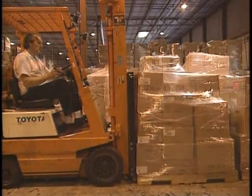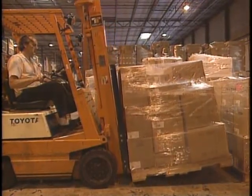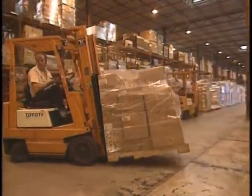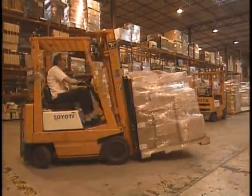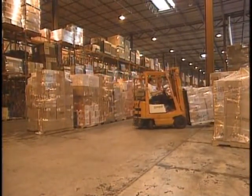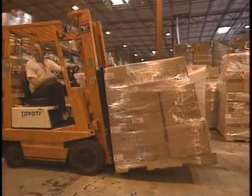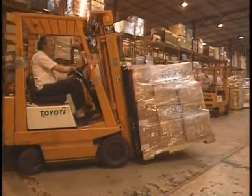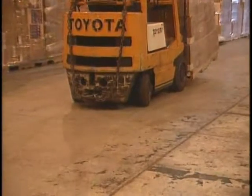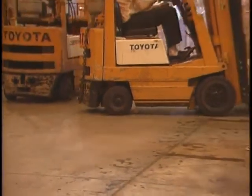Another factor when traveling is compensating for the rear end swing of the truck. Let's watch as this operator moves in a staging area of a warehouse and makes a right turn to load a trailer. The unattended lift truck parked in the staging area creates a hazard for other operators. Think about the safety issues this operator should be considering. Now let's watch again and hear what the driver should have been thinking: 'This is a staging area, so I'll have to be especially careful. The area looks clear — no pedestrians. I don't have much room to make the turn with the other truck parked there. With my rear end swing, I'll have to be careful. I can't see down the aisle, so I'll sound the horn before I turn and I'll proceed with caution.'